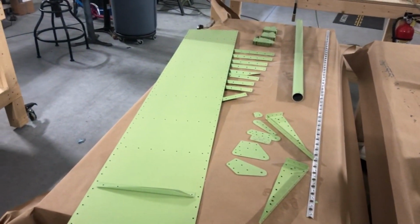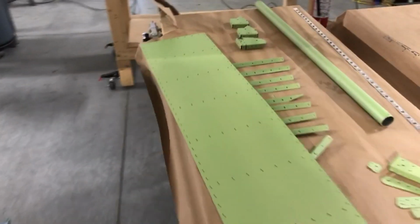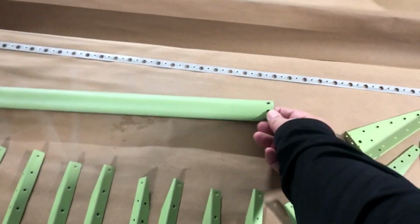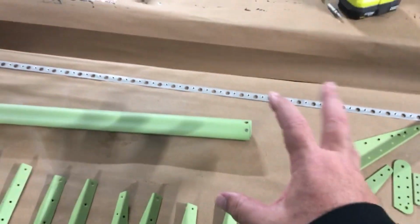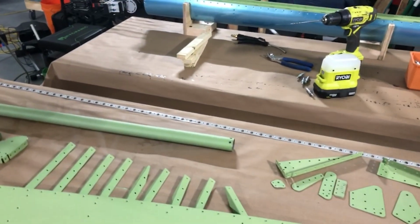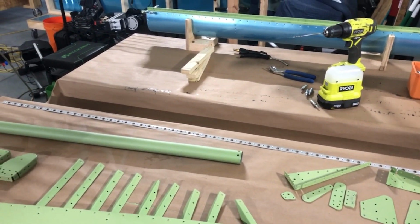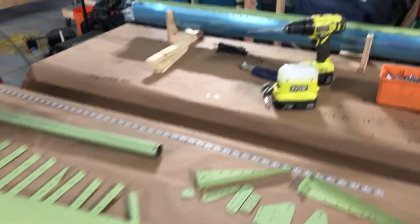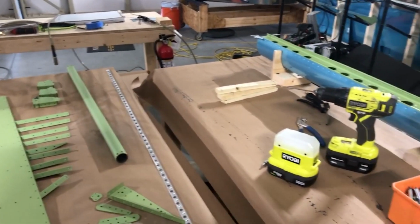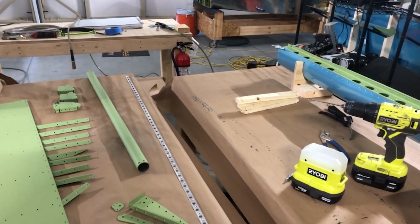Nothing major. Like I said, doing some back riveting. You guys see me do that before. You're gonna see me test out. I enlarged these holes just a little bit larger than the plans that give me some room to help take out some of the pillowing that happens in the skin. If you guys remember on the last aileron that I did, I had to take it apart and enlarge those holes a little bit to allow for the skin and all the pieces to kind of move, have a little bit more flexibility there, and then get themselves in alignment, and it'll take some pillowing out.